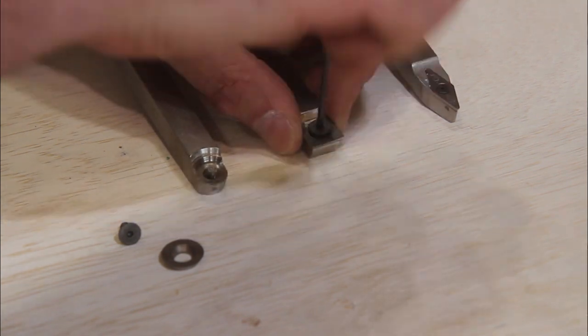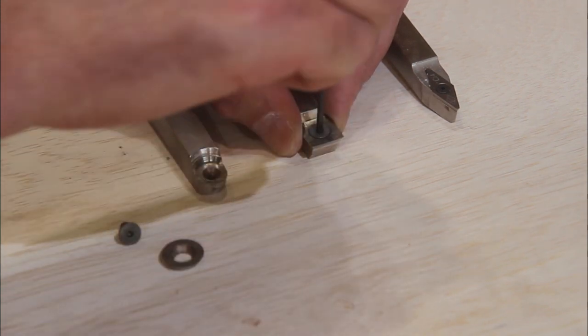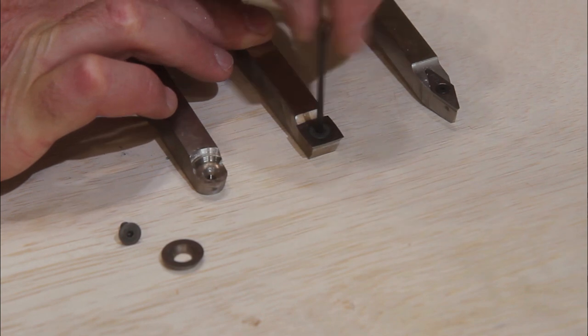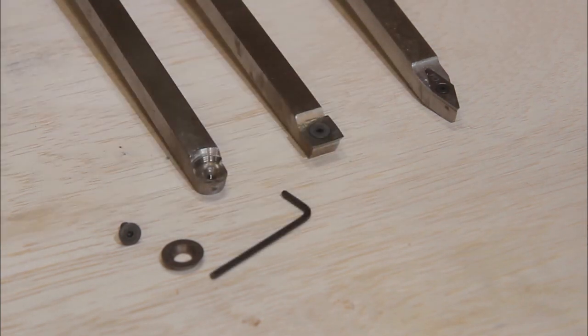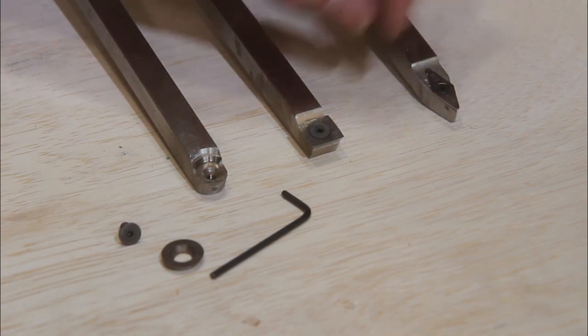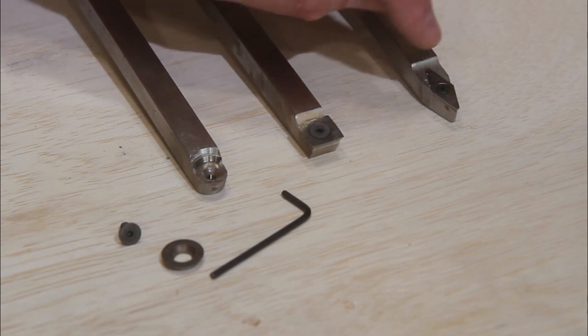Make sure the mounting screw is free from debris, glue, sap, or shavings prior to inserting the hex key. You can use compressed air, the tip of a paperclip, or glue remover to clean out your mounting screw. It's important to always use a new mounting screw when replacing your cutter. A new screw is always supplied with our replacement cutters.